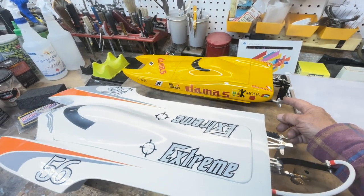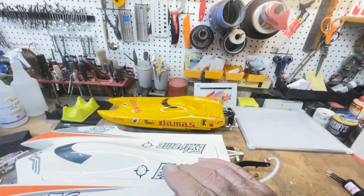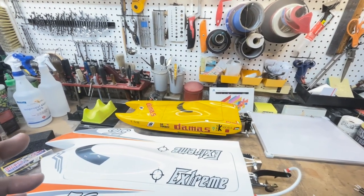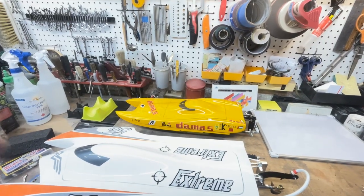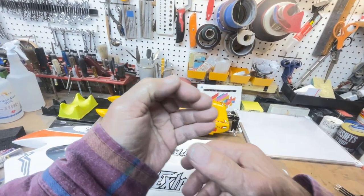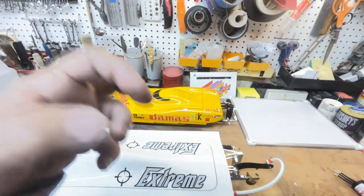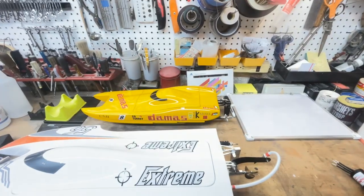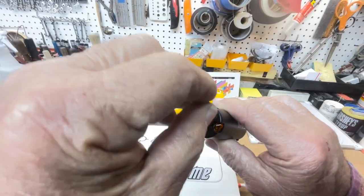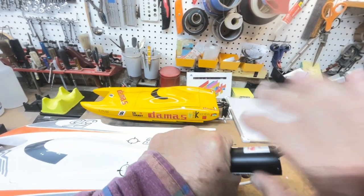So that's the most efficient way to transfer power. When you think about it, you go directly from the propeller to the hull — you forget all those rotating parts inside. The next best way, and this is where Big B finally got it — I couldn't see the front of the TP motor. I know his end bell has the bearing installed from inside, so the bearing is pressed in from the inside. That's good for axial loads going that way. But I couldn't see which way his front bearing was — his back bearing, actually. Was it pressed in from the outside, or pressed in from the inside like his end bell?